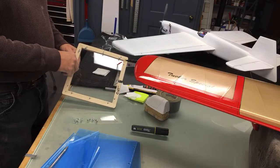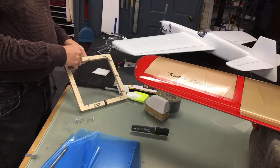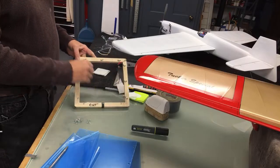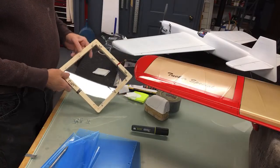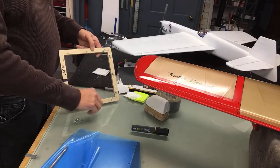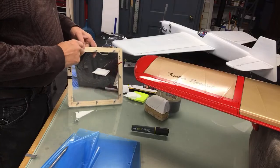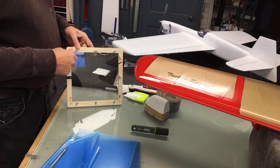This mold that I got is plaster of Paris. I don't put anything on it. When I molded it, it was molded against a piece of Lexan plastic, so it's about as smooth as you can be, smoother than probably you could paint it. But it's very delicate, you know. This isn't a lasting mold by all means. Well, if you wanted to make a lasting mold, it should have been done in Mold Max. Yeah, there's tons of plastic molding materials. They can get sort of costly at times. This is relatively inexpensive.